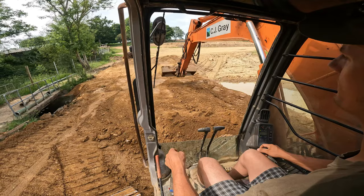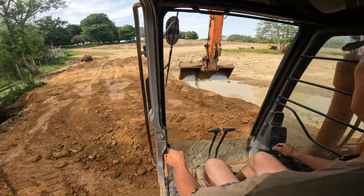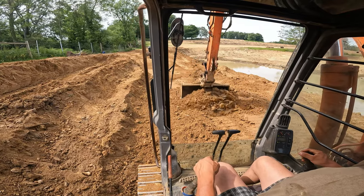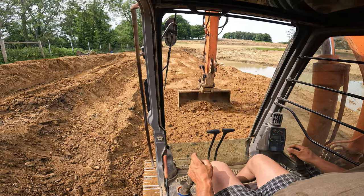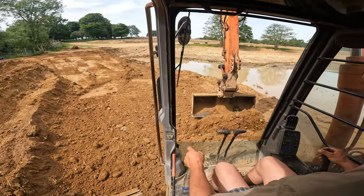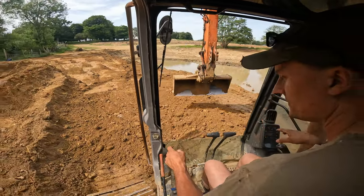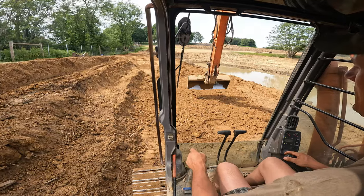You can see we overfilled it here and it's been compacted very well by the dumpers as well. At the very end we just cut the side and shape it to the three-to-one ratio. That's it — on a thin layer like that. You don't want to just fill the hole out with the dumpers, track in and tidy up — that's not going to work. It will lose its compaction and over time, or just under traffic, it will move.